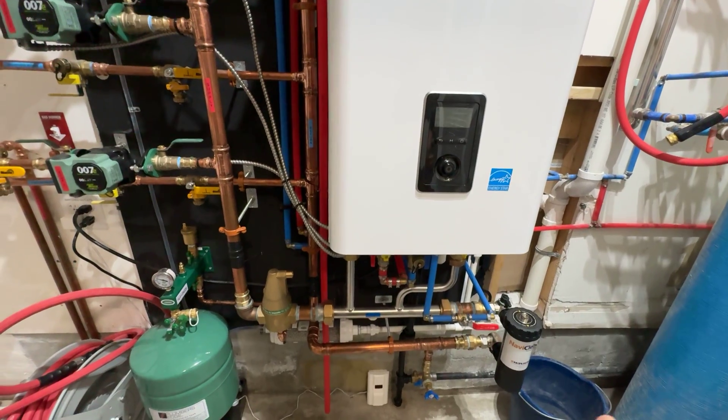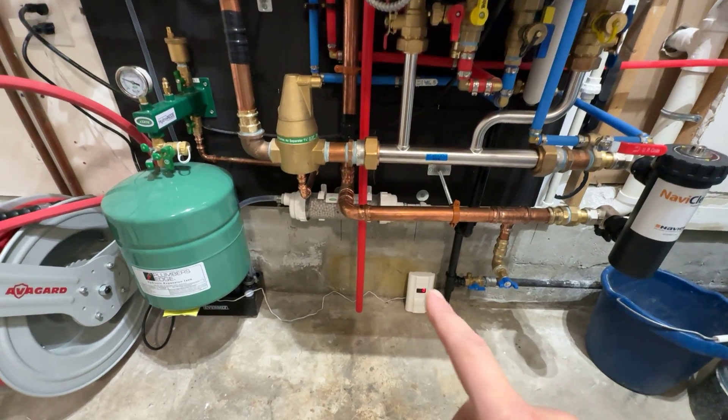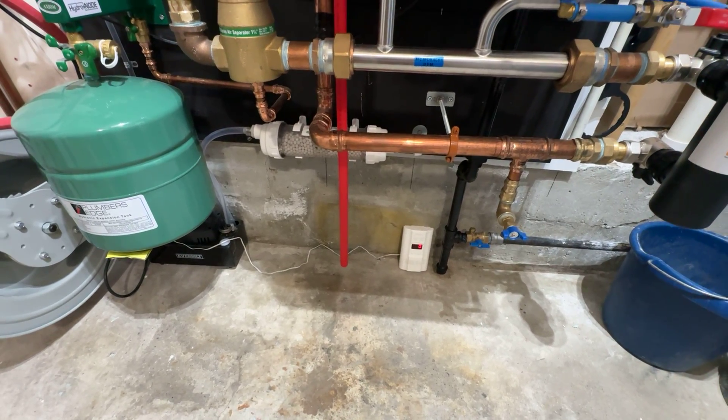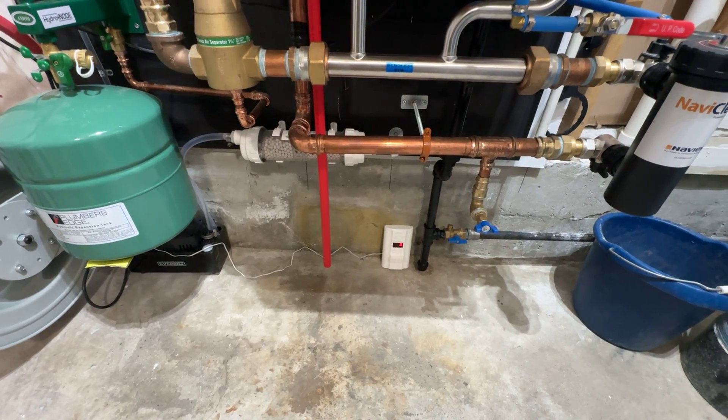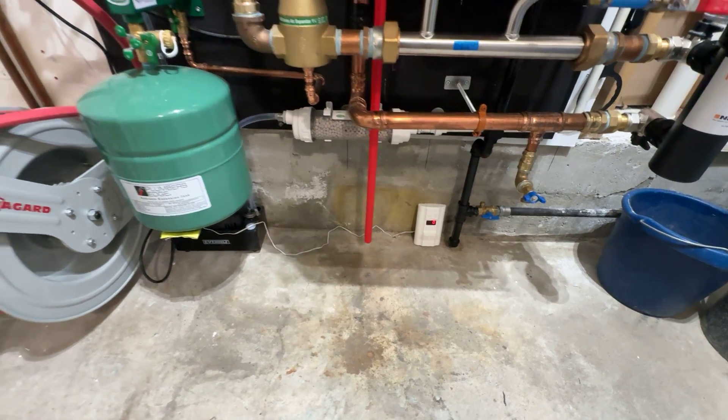Not that I'm a professional, but I chose to do it on my own. So here's my gas piping. I got a propane detector down there in case you ever get a leak. Propane's heavier than air, so you have to put that detector as low as possible — so I got it sitting down there.